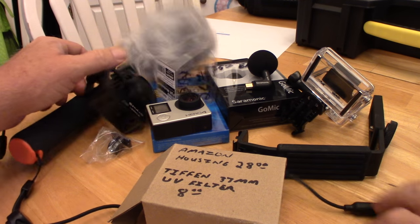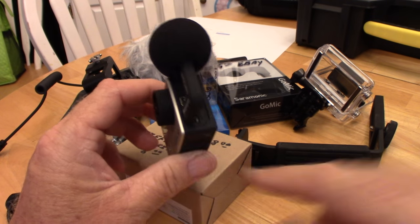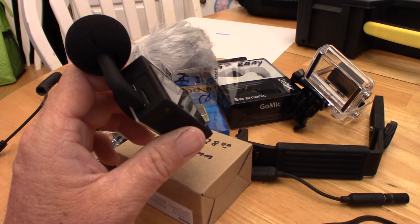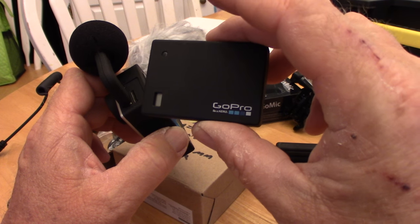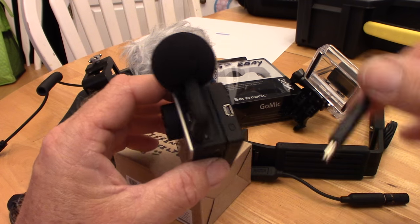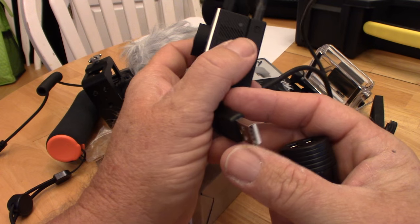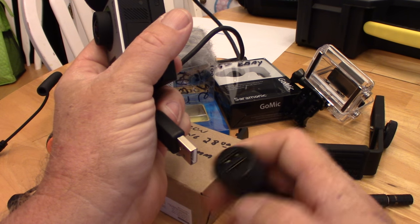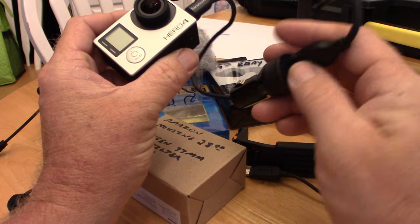Now, battery life. Here's the problem: once you plug a mic into that port, you can no longer get your power cord to the camera, and you're powering a mic, so it drains your battery quicker. The hack around that is to buy a battery backpack. I'm a big fan of GoPro factory stuff, so I got the factory one — there are less expensive options out there. The battery backpack for the Hero 4 is $50. It simply snaps right on, you can plug your power cord into it, and the other end is USB. You can plug it into a computer or into a cell phone battery backup. I run mine plugged into a cigarette lighter adapter on my boat, truck, or ATV.